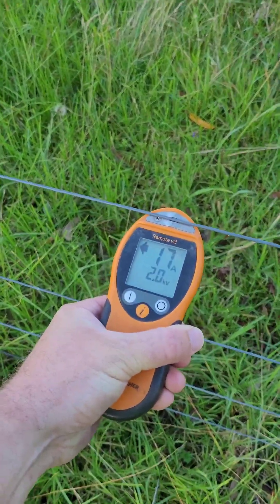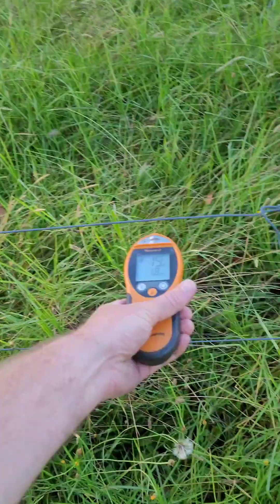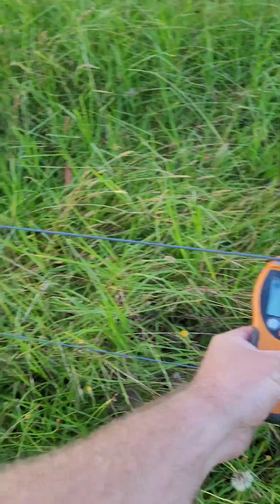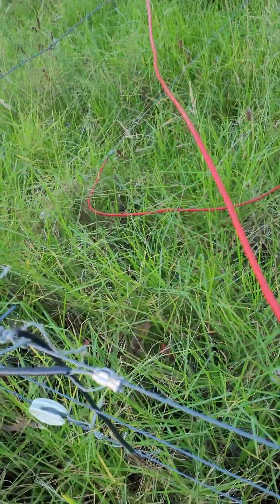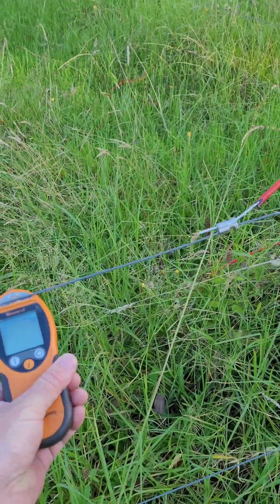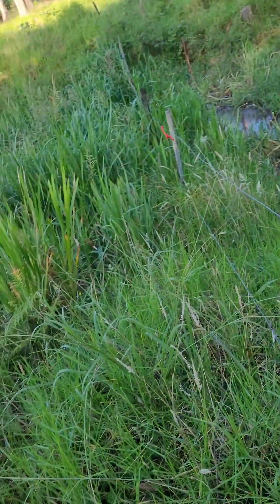Before the junction it reads 17, then 19. Out this way we have 28 amps going that way — very likely it's that direction. I'd like to get over there to make sure. It's interesting that the red one goes into the ground from the other side of the fence. This one has 10 amps — not as big, but there'll be something along there as well.